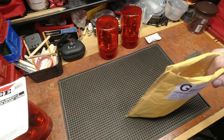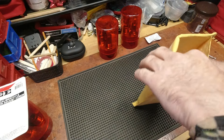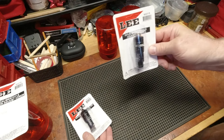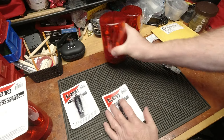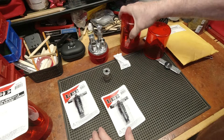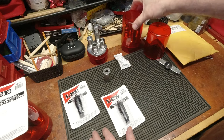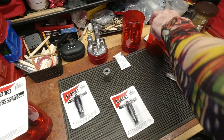We'll now do a little unbagging. We have the handgun micrometer screw adjust, and we have the rifle — the standard rifle size. What we're going to do is step back and redo the 223, because for 308 my OAL doesn't vary as much as 223. I think I used 308 in my example for large rifle, and I want to say it was at 4.41 on the micrometer adjust, so we'll see where this lands.